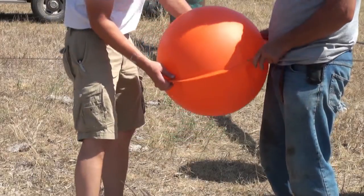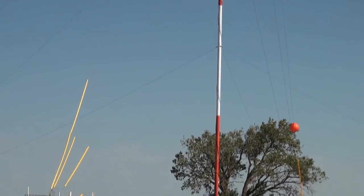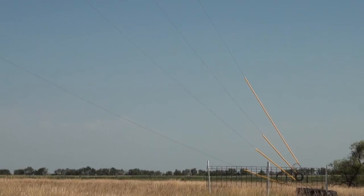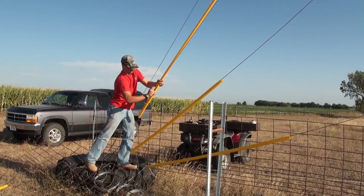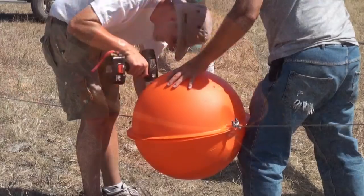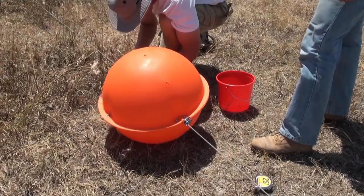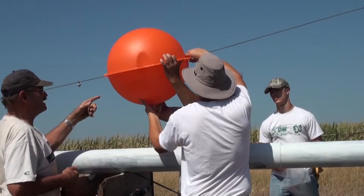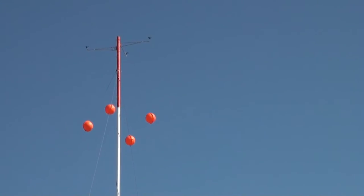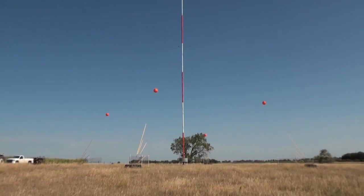While the paint is drying, you can begin to affix the orange marker balls and sleeves to the guy wires. The FAA recommends one high-visibility sleeve on each guy wire anchor point that will reach a height well above the crop or vegetation canopy, and another sleeve installed on each of the outer guy wires. The FAA recommends a total of eight high-visibility spherical marker or cable balls of aviation orange color attached to the guy wires — four at the top of the tower no further than 15 feet from the top wire connection, and four at or below the midpoint of the structure on the outer guy wires.